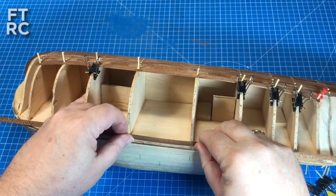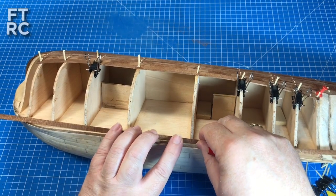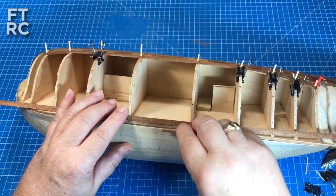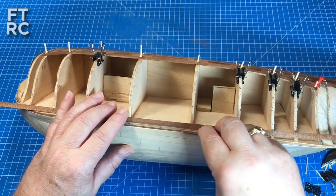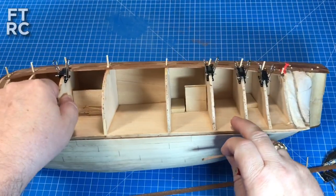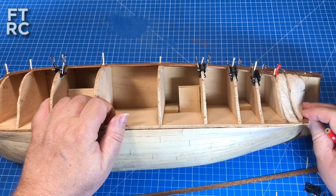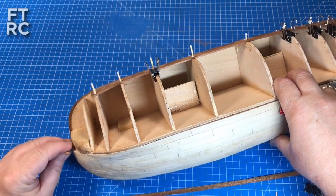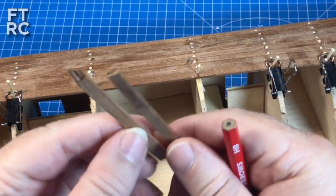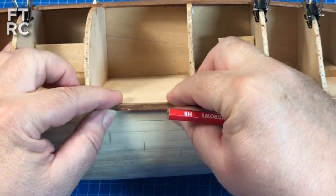Now, we can calculate all that now, actually, by laying this plank in position. And the garboard plank sits, they don't sit over the top of your keel, right? You have to leave this keel space, because this is actually a false keel here, you're going to have an actual keel that glues on here afterwards. And it runs through, and there'll be a stem that goes to the front here, and you're going to have your rudder here. So all that's got to be added later, and we have to leave room for that. So that's why we basically try to get this end part here to the width, and we make sure at the front of the bow here, we leave the width of our stem. It'll be slightly wider than the plank. So this works out at twice the thickness of our planks, our thick ones. So that's basically, yep, that's about right. So that's what we need to allow for.